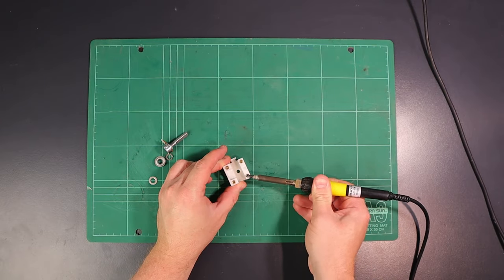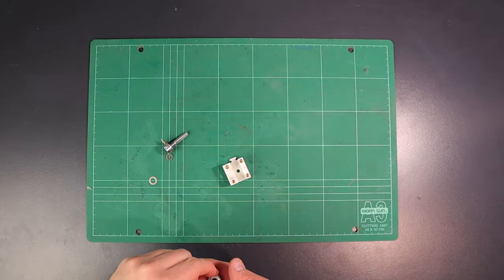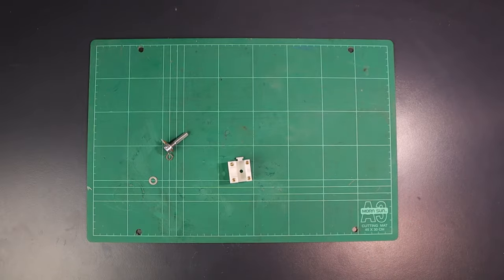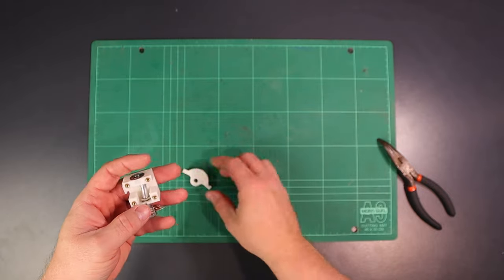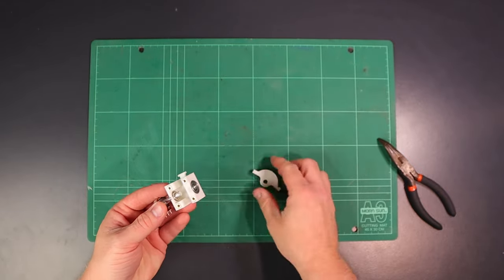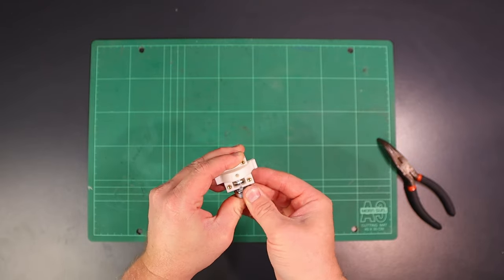The whammy bar mount is entirely 3D printed. I'll start off by fitting some M3 threaded brass inserts, and then I'm going to press this R4ZZ bearing into the side of the support. A 10K potentiometer slides through from the other side of this bracket, and the bearing supports the shaft to prevent damage to the potentiometer. You could probably do this without the bearing, but eventually the side loading on the potentiometer is going to wear it out, so the bearing should increase its lifespan dramatically.